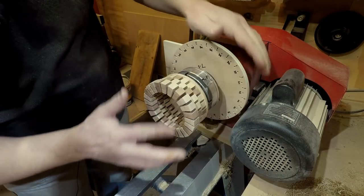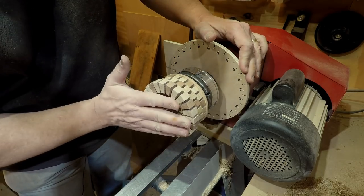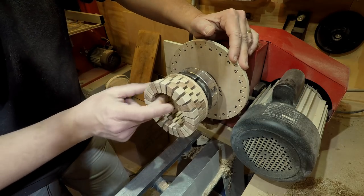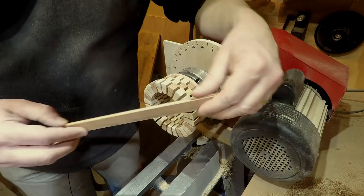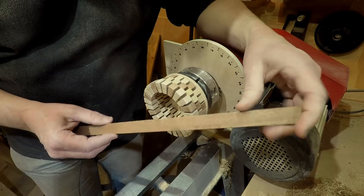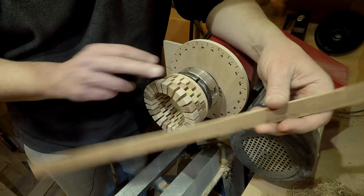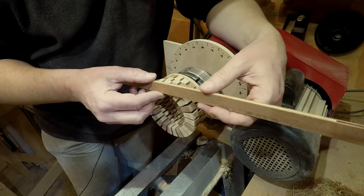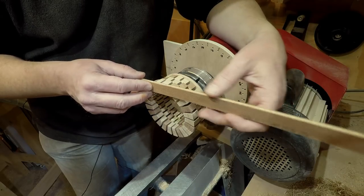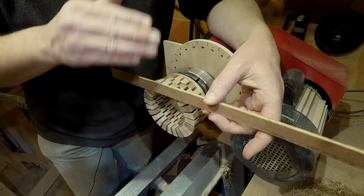That's now the third row on, and when this dries properly this time, I'm gonna start shaping these levels. I will be cutting these next, which I glued up, so it will be interesting to see how these look on there. Where I've gone 10, 10.5, 11, these will be 11.5mm, so again, there'll be another slight step out, the same as the rest of the pieces so far. After that, I'm going to start doing more of an exaggerated curve.